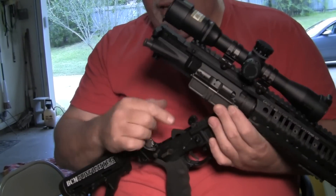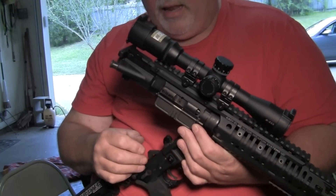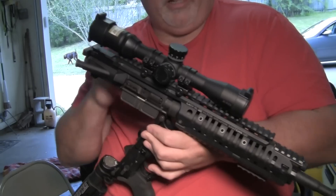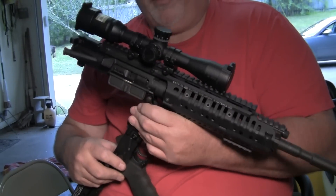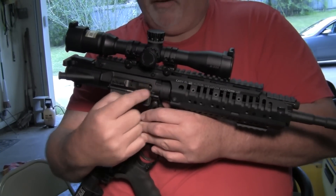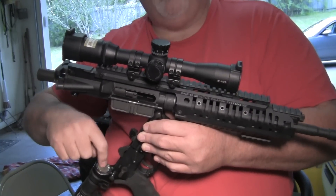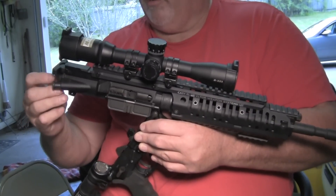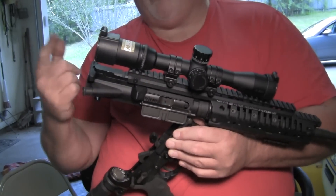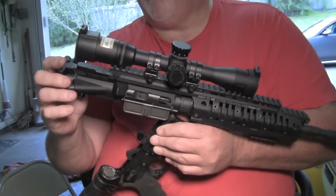You can brush any areas free from carbon and stuff like that. This gun right here runs much cleaner than the Yankee Hill because it has a gas piston design. It's not the direct impingement where it blows hot gases up into the front of the upper receiver, driving the bolt carrier backwards into the buffer tube. Notice that this bolt carrier wants to pop out — it won't on the Yankee Hill. You had to pull it out because this one is spring loaded.